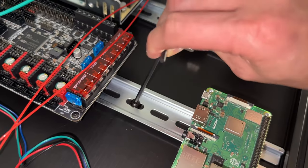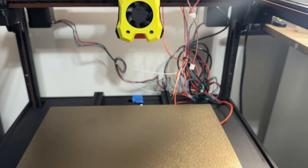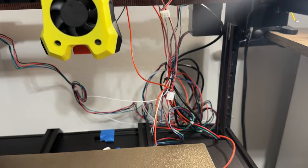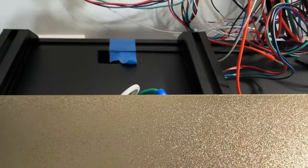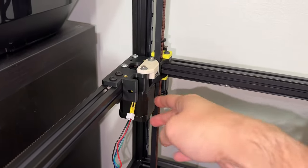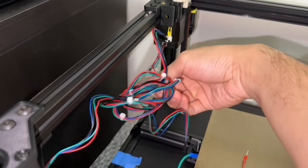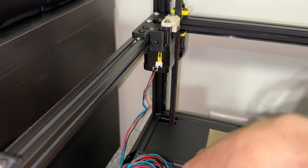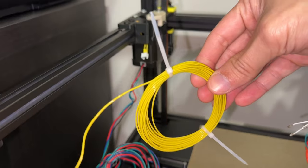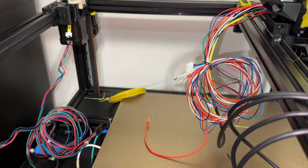Next video is wiring and depending on your setup, you may have choices. In my CAN bus setup, I only have the Z cable chain, whereas the traditional setup will also have X and Y chains. What's important to note is that silicone wire is minimum spec for running inside these chains, and some have had better luck with PTFE wiring. This Y endstop, along with the AB motor wires, will need to go through the Z cable chain. Therefore, if these are PVC wires, you will need to terminate and use PTFE or silicone wire before they enter the chain. PTFE wire is more expensive and if you buy from AliExpress, it takes time to ship, so figure out how much wire you need and start ordering sooner than later. As always, please like and subscribe and see you all next time.